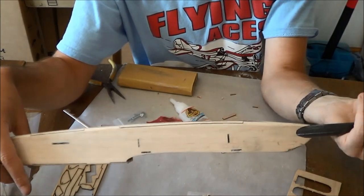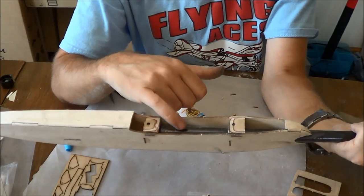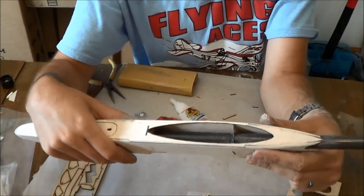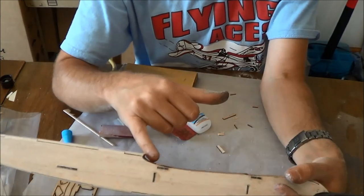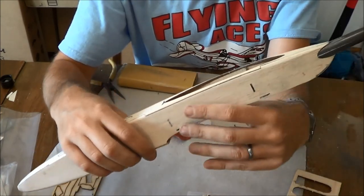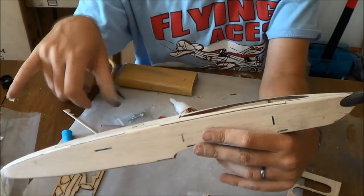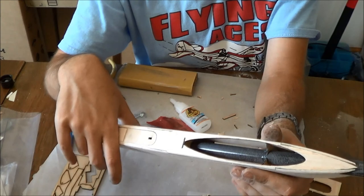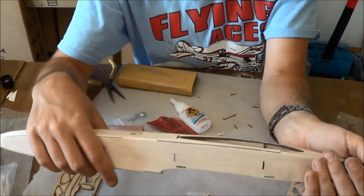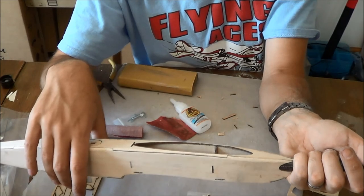At some point, most of you in your configuration of this airplane are going to have your wires coming up through the middle from your wing. They're going to come in here and need to go up forward. There's no gap here. So my personal recommendation, there are a couple of options. If you can get in here to put holes through on the bottom, it's kind of hard to get to that. What I recommend is drilling in through the top here to run those wires forward. Hopefully, in the future, once we firm things up a little more, I'm probably going to supply these bulkheads with that hole already drilled. But some of you will not. For those of you that are not building it with a rocket tube, this is going to be a late stage in the game to deal with that.